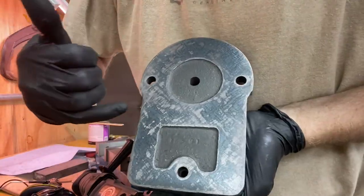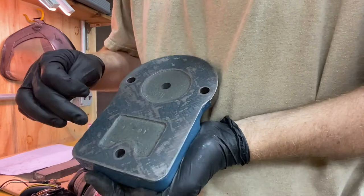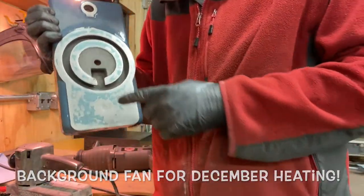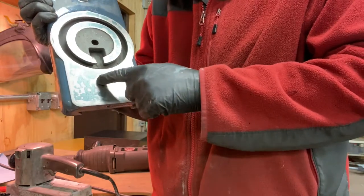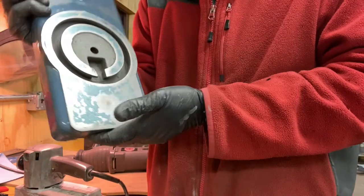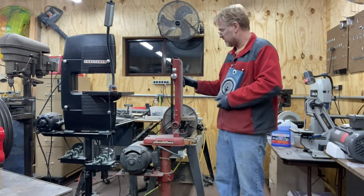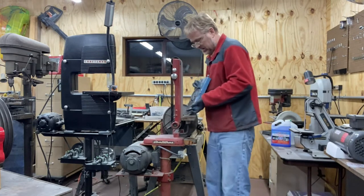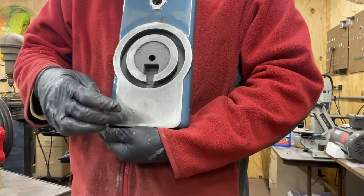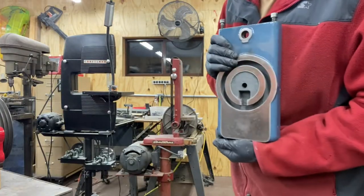After many cycles I'm feeling pretty good about this — I've got coverage all in here. Part of it has to do with how hard I push and how much ink is on the stone. I'm pretty satisfied that's a good flat surface. I'm going to scrape in this surface now, but I found there was a pretty big hole right in this area. There's no point working at all these individual areas when the whole thing isn't relatively level. I have a belt sander with a machined surface underneath that should be flat, and even with that I can still see a substantial hole here.